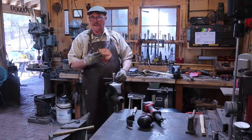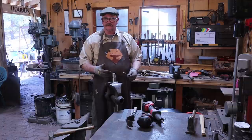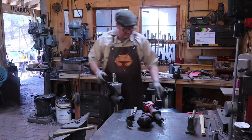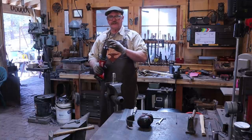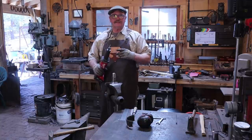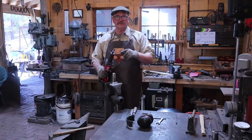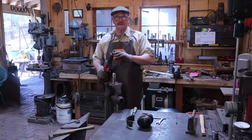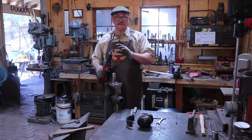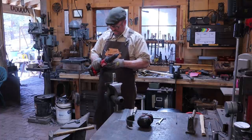I rarely have to re-handle my top tools — on my older tools, some of these handles have been in for 15 or 20 years. I'm going to do that with a die grinder with a carbide burr. These are real easy to break, so go slow and be careful. Any jerky moves and you can easily snap one of these carbide bits, but they do a fast job and they're really effective. They also aren't cheap, so you really don't want to break one and have to buy another one.